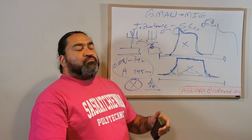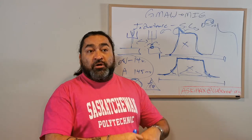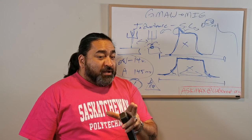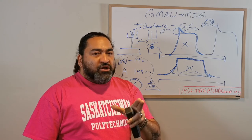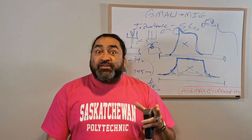Okay? So don't be like, oh, my inductance is making the weld hotter or my inductance is making the weld colder. No, what you're doing is you're using the heat differently. How are you going to place it? Where are you going to put it? And what are you going to do with it? All right. Play with that inductance.